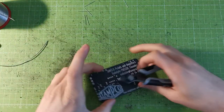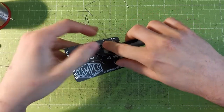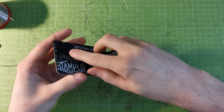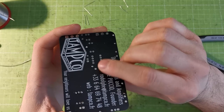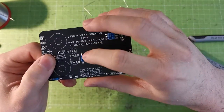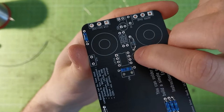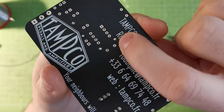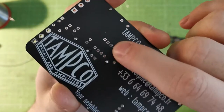Also, when cutting the legs, don't cut right on the solder joint — cut just above it. You don't want to damage the solder joint you just made. The solder joint should not look like a circle or bubble sitting only on the component leg. You want it to flow through the pad and form a little dome or cone on the surface, enclosing the component leg firmly into the PCB.